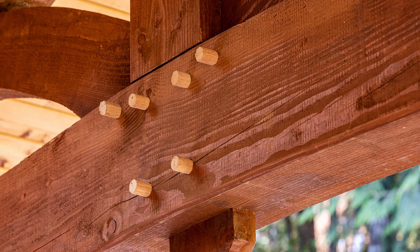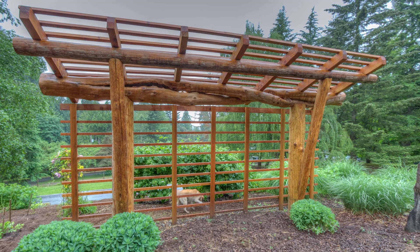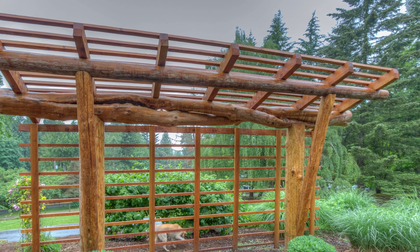We as a company don't experience that because we invested in a big mill — one smaller mill to cut fast and accurate, a big mill to break them down. It's got a 54-inch throat, 52 and 44 feet long is what we can cut. So that's a thumbs up for avoiding the unobtainium problem. With boxed heart you're going to have more availability. Now we have had people where they want more checks — they want that rustic look.